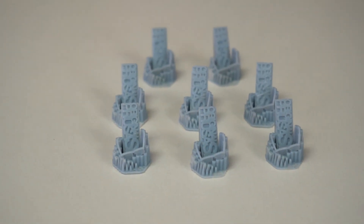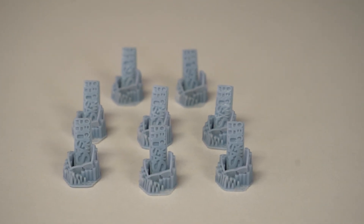After the calibration, I moved on to printing some more jewelry-based models, thinking it was going to be a piece of cake. At three and a half seconds with supports, none of the prints actually came out — they all just fell off; there wasn't enough strength. So I moved on to five seconds, which showed a lot more promise, with further improvement at seven seconds. Some models would print perfectly while others would be an absolutely horrible mess, and oddly it was always different depending on the model.